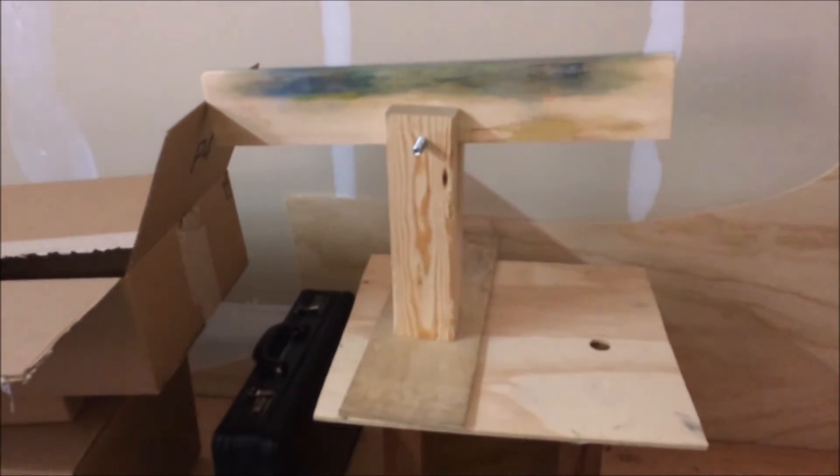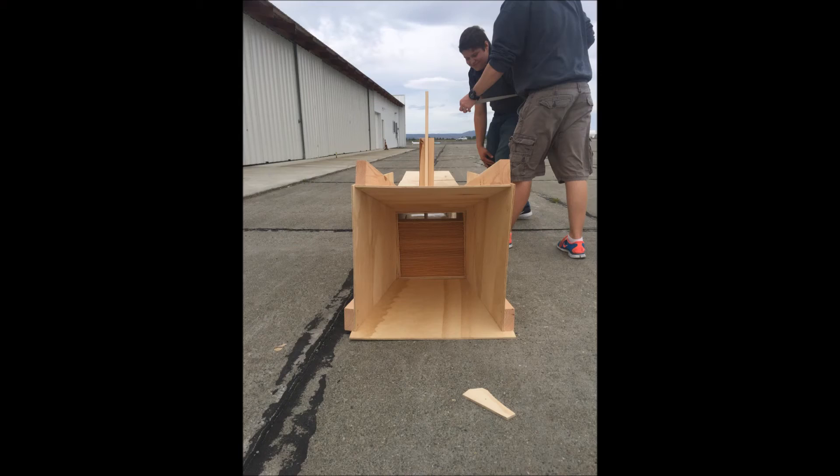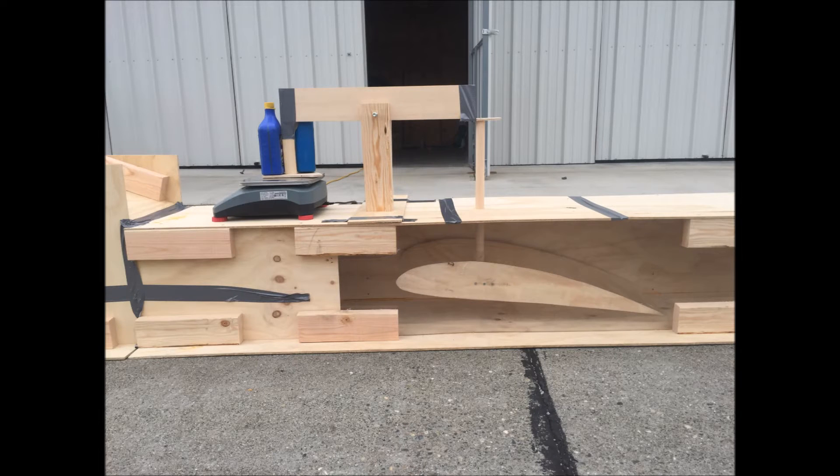Even with just those 8 miles an hour, we were able to get some good data — about 7 knots when we lined the thing up with the hangers. You can see the baffles in the back end and the duct tape holding the whole thing together, plus the scale and the actual airfoil inside that we were testing. It produced about half a pound of lift at 7 knots for a one-foot chunk of the wing. We calculated that at 35 miles an hour with a 30-foot wingspan, it would produce around 450 pounds of lift.